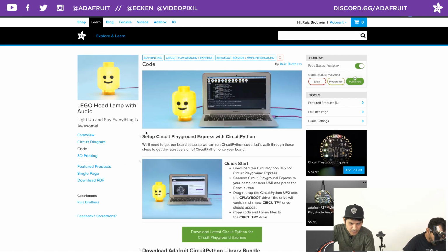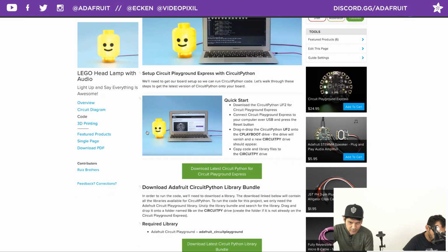All right, jumping into the code. Real quick start on getting CircuitPython. Just go to circuitpython.org and browse through the many awesome hardware that's supported for CircuitPython. And then you download the UF2 of the latest version of CircuitPython. Right now we're at version 5 alpha 4, I believe. Or you can do 4.1, which is the stable release. So once you download that UF2, just plug in microUSB, hit the reset button. All the LEDs will turn green. And then you'll have a new drive that's loaded in your computer.